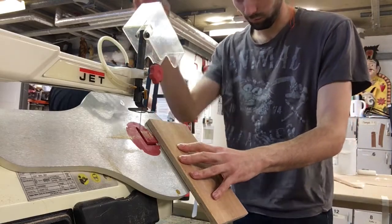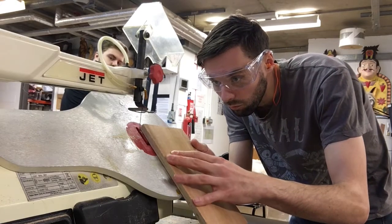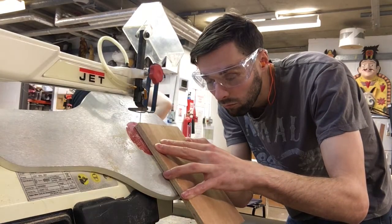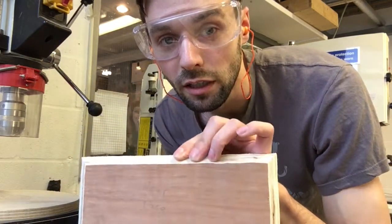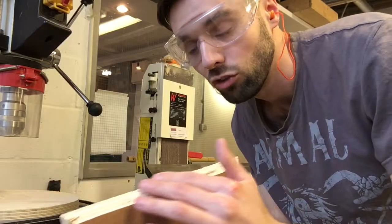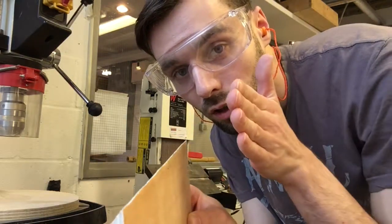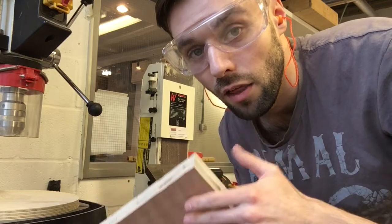The original idea was to cut out the wood pieces at a 45-degree angle, as you can see me doing right here, so that once the corners joined up they would have a nice clean 90-degree joint. Now that I've got all the angles cut, I'm going to quickly run them over on the belt sander at a 45-degree angle as well, just to make sure these edges are all nice and flat. The saw doesn't leave such a great edge, so I had to do it by hand. I'll just run these on the sander and then we can go ahead and join them together.